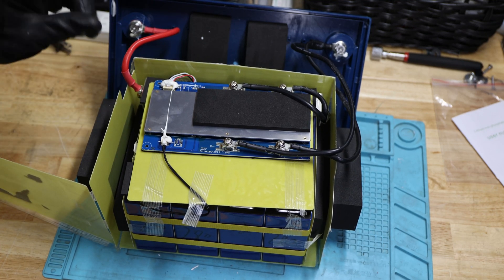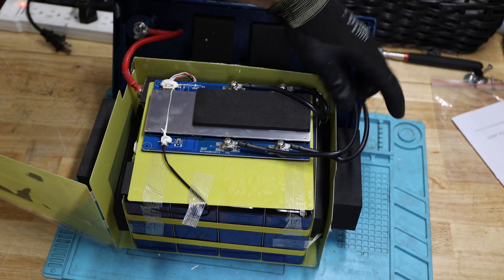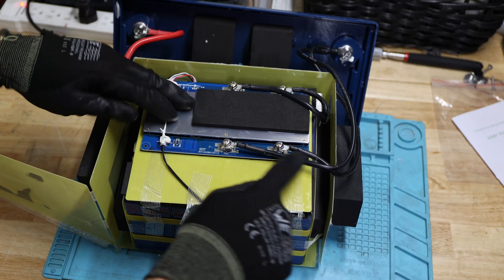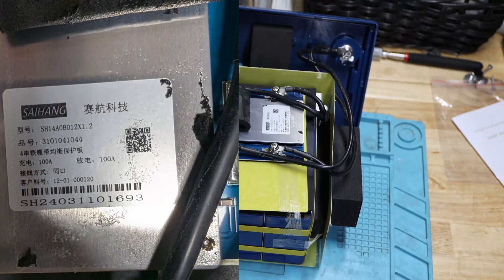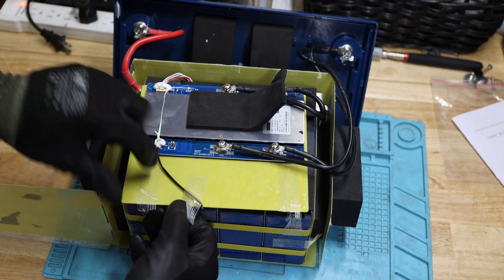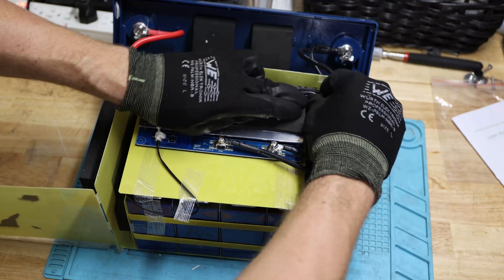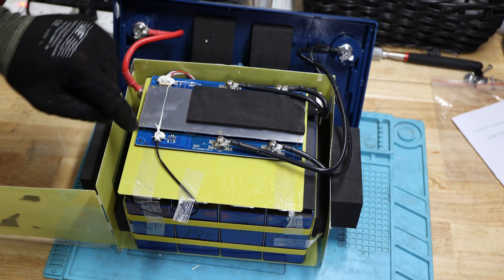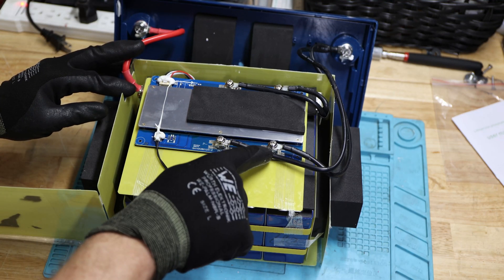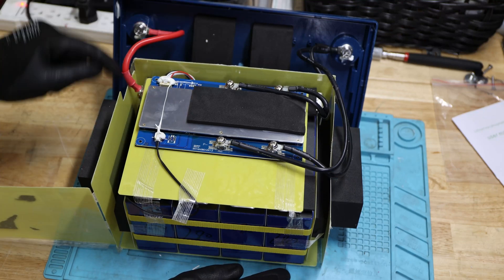There's a blob of glue over here and also a glue blob over here — I guess that's basically the Loctite they use. There's also a mark that they torqued it down here. On this side we have two 10-gauge wires — wow, 10-gauge only, interesting. Going over to the BMS — it's a Cihang branded BMS, up to 100 amps. Haven't heard about it — by the way, no Bluetooth, that's what it was advertised with. I can see there's a temperature sensor which goes somewhere into the cells. We have a heat sink for the BMS, the balance leads are glued, same with the temperature sensors — nothing's moving. There are some torque marks on those bolts, though no glue on them, which is interesting.